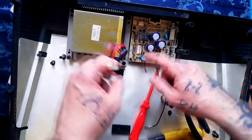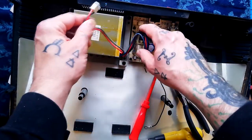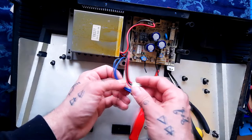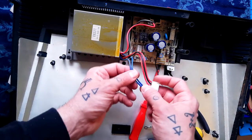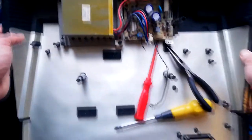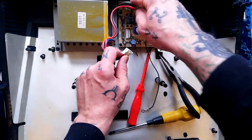There are two sets of cables coming from the transformer. I guess this is the AC input from the wall going to the primary coil, and then — assuming there's some relationship between the two red wires and the two blue wires, like they're duplicates — maybe they're both whatever 30 volts AC and both 10 volts AC, so they could be sent to different rectifiers. I'm pretty sure that's the secondary side and that's the primary side.